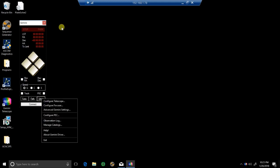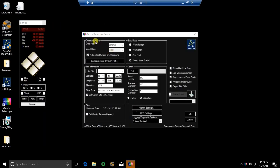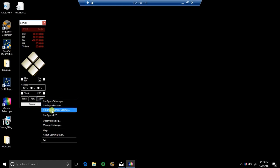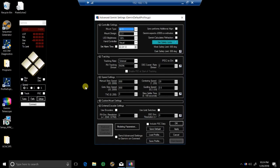If I remember correctly, I loaded the ASCOM drivers first, then had to go into configuration and configure it for ethernet with a 9600 baud rate, and then went to the gemini-2.com site and connected for ethernet. I probably should have done this video when I was actually doing the setup, but it didn't occur to me. If you get sidetracked and you're not sure what to do, drop me a line and I'll forward you the Roswell Astronomy club email — we can exchange phone numbers and I can walk you through it. Load all your ASCOM drivers and everything first and then you should be able to go right into it.